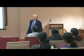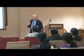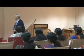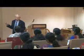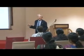Draw-out breakers, that's another disconnect device. You open the breaker and then you can pull it out. Well, pulling it out isn't an electrical function, but you need to know about it. So there's several things like that. I like to have those things written on the one line that I'm working with. It makes the single line a little bit messy, but the information is there.